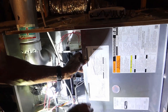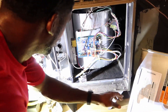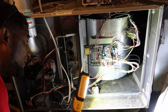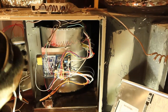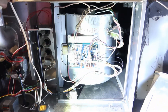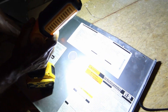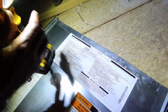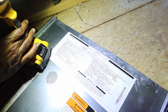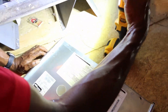The thermostat could be not allowing it to turn on. Good — I didn't lose power because they got tape right here. So it's a fuse right here, and that fuse is not blown. You see that amber light? It's solid right now. I'm going to look up what a continuous light means — it just says it has 24 volts. That tells me it's not blinking or anything. If it was blinking, there'd be an alarm. So we have 24 volts.